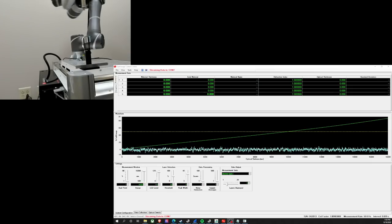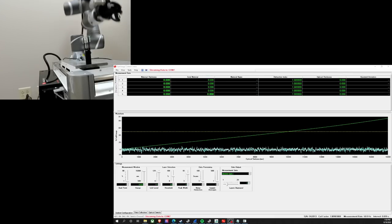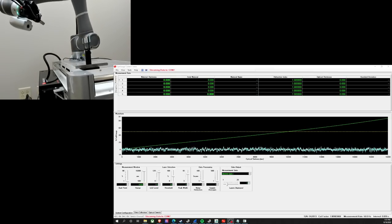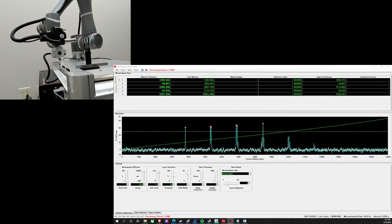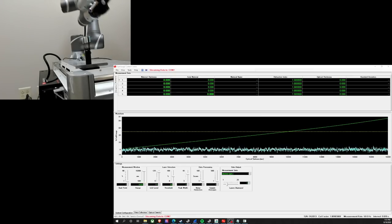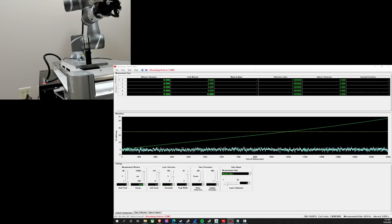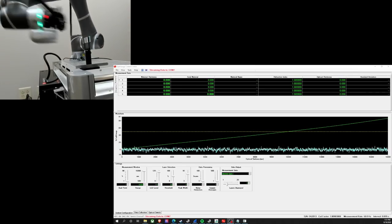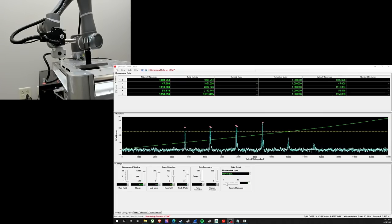And the way it works is the camera that's mounted at 90 degrees to the Lumetrics OptiGauge probe first takes a picture right here. It just took a picture and said, hey, I know where that slide is. Now I know where to do my measurements. And now it did those measurements and it flipped over to the other side and it's measuring the other six measurements. And it'll go through another cycle again. It's just going to cycle through it. There you go. Took a picture. Now it knows where to measure.